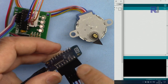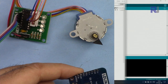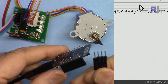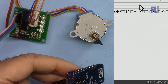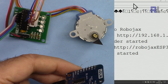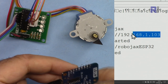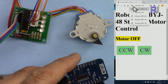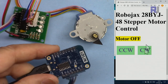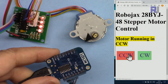In some cases when you press the reset button and you don't see the IP address information on the serial monitor, disconnect all the wires, press reset, and this will now show you the IP address. So 192.168.1.103 — then reconnect the wires. I'm going to 192.168.1.103 from this module and clicking — it works perfectly.